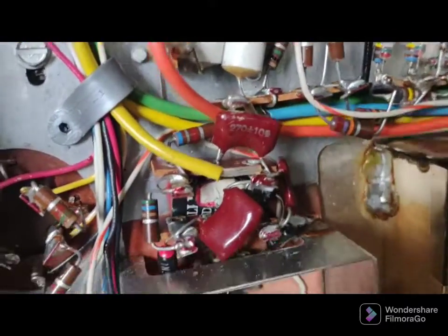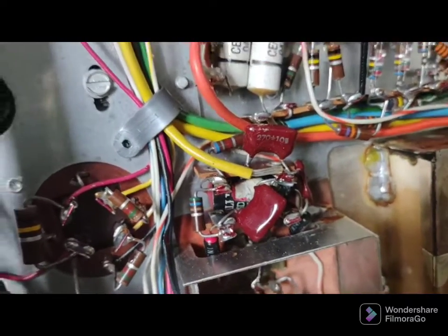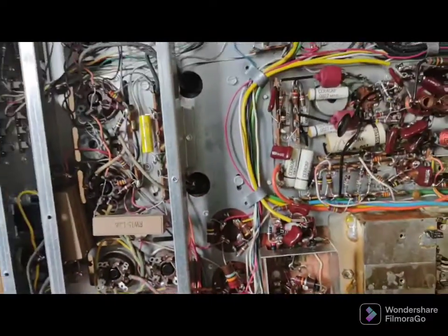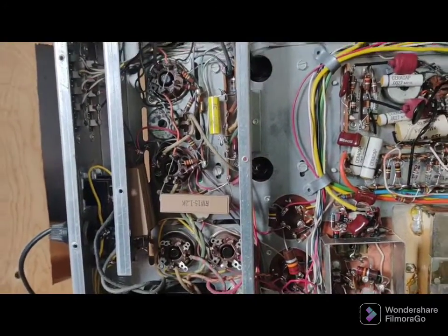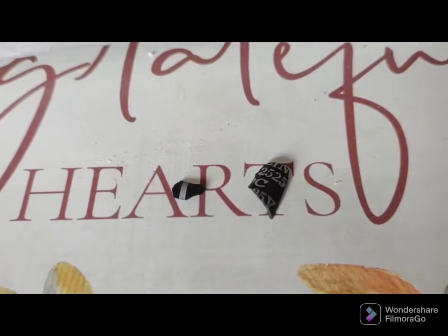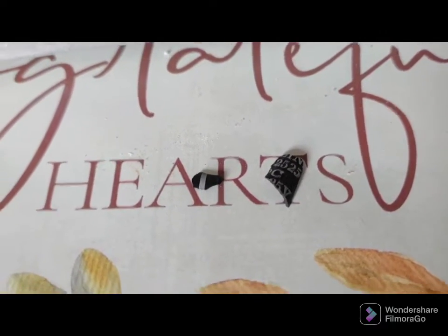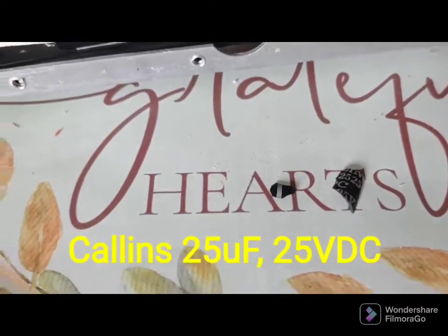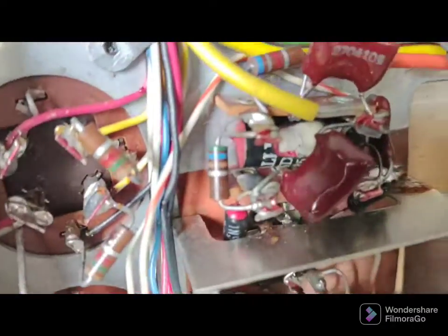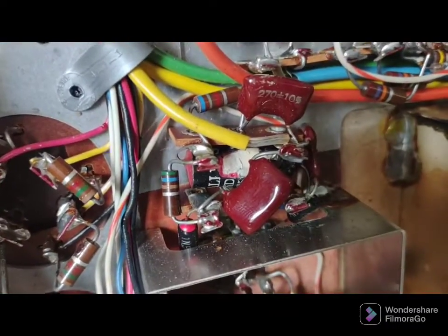The other day we were listening to the tuner and it kind of just faded out — and there's a reason why I'm talking about the tuner. We weren't listening to the tuner when we heard the loud pop; we were listening to vinyl. I opened this up and saw fragments at the bottom. I know Scott used these Collins capacitors, 25 microfarad, 25 volt. Looking around with the schematic, you can see the cap right there — it's in the IF circuit.